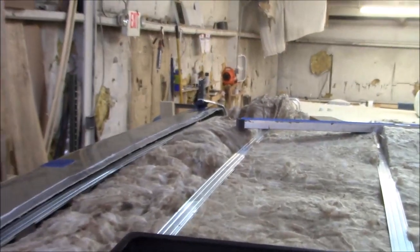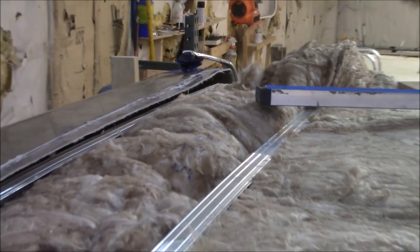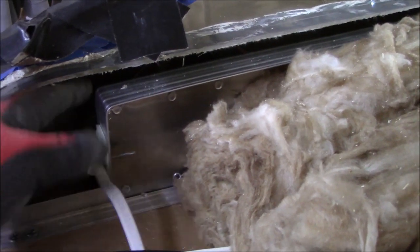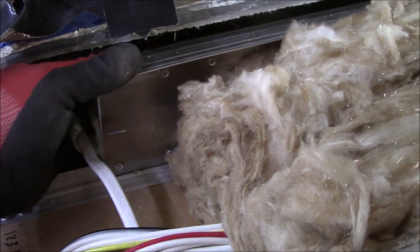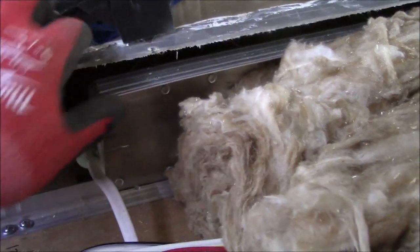What I don't like looking at this is the elevation from here to here — it's not quite the same over there. You can see that mold. When they molded that cap, that's not right. It still has to get screwed down. Here's my problem: if I go put some screws in here, this is cheap aluminum — it's going to pop back up. When it pops back up it's going to probably break some caulking loose, so it's going to be a problem. I want to get a wood blocker in there. It'll have the decking on here which is good, but especially in that corner, it would want to be prone to kind of popping loose.